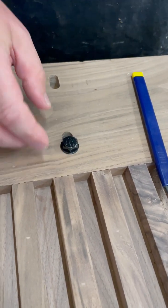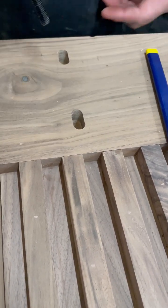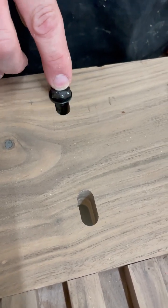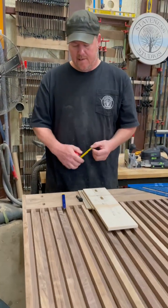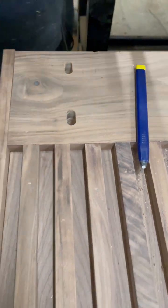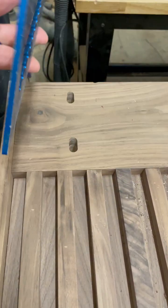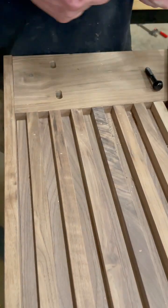That's where my mark is, and I made a little room both ways. Initially I thought I'd have the factory measurement land at the bottom of the hole and tighten everything there, but I actually moved it up so I've got up-and-down adjustment. Before, I'd grab my tape measure, go to the square, measure and remeasure. I even made marks on my square trying to do that — you can see there's my barn door mark — but check out all that guesswork I eliminated.